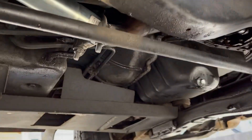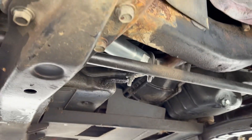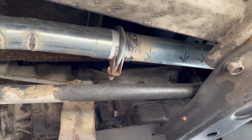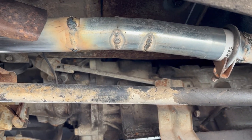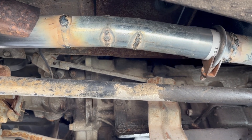Let's take a look at it. Now, it's by no means perfect, but starting up here where it was cut, I got it welded and clamped — just because I couldn't get all the way around on the weld. It's also welded here; I'm going to take the clamp off. The clamp was there temporarily for the right length. I slid these two pipes together. I had to make a couple pie cuts and bends here — just cut out little slices, bent the pipe over, and welded those sections up.